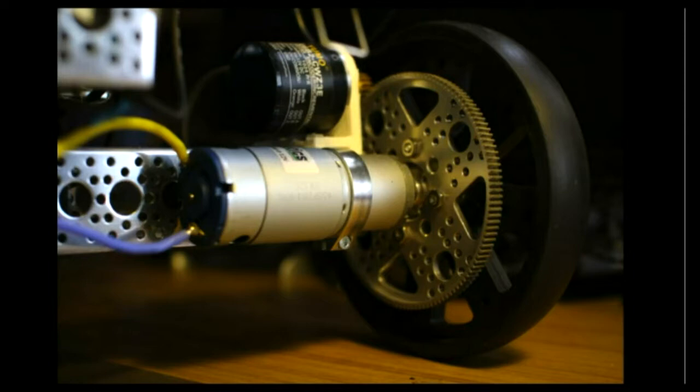That's a side shot of the motors. When I first got them, I noticed they were attracting nuts and bolts — they're magnetic even when not plugged in — which was an interesting step up from the smaller gear motors I'd used before. And you start playing around with 14, 12, and 10 AWG wire to hook things up so you don't burn your wires when stalling motors for a prolonged period, because breadboard wires go up pretty quickly.